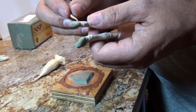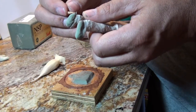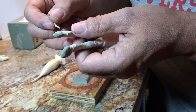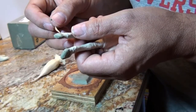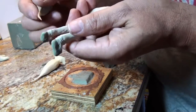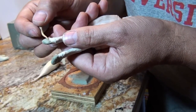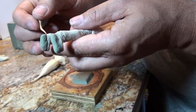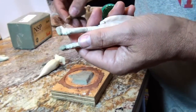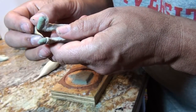The detail on the sole of the shoe is very tricky. See, the sprue is the only way you can get your resin in and the air out. So you have to have a balance between detail and function. This function, I should say. It's very much a fine line that I'm making right here with this homemade tool. If it's too deep, you're going to have too much of a ridge and it'll trap bubbles, and it will restrict the flow of fluid and air. But if it's not deep enough, you're not going to be able to tell where your sprue ends and your sole begins.